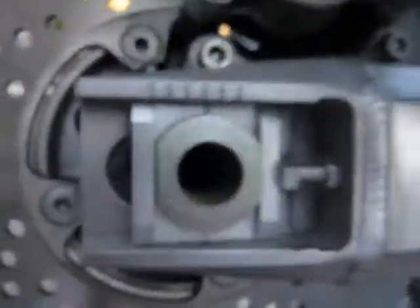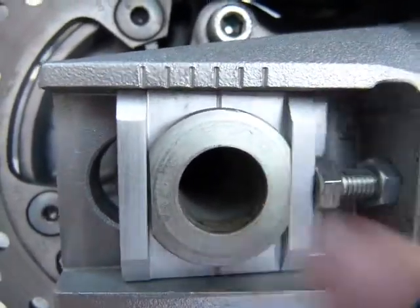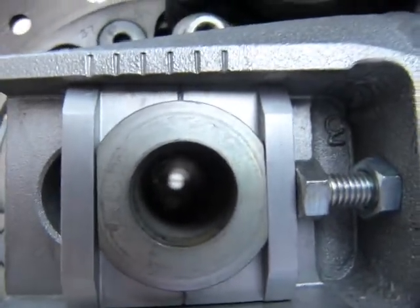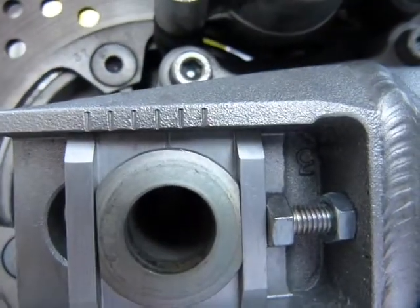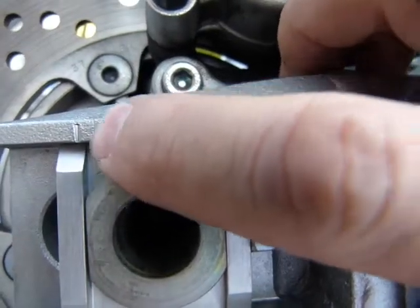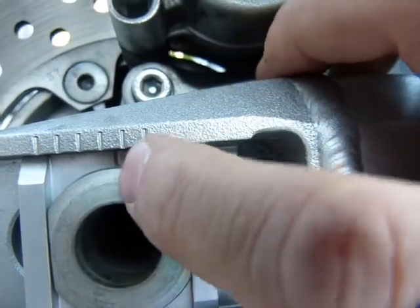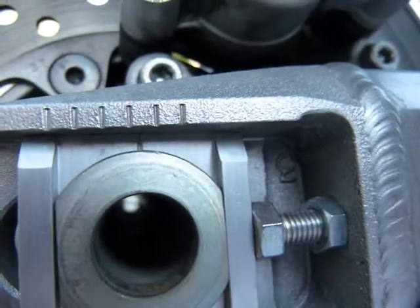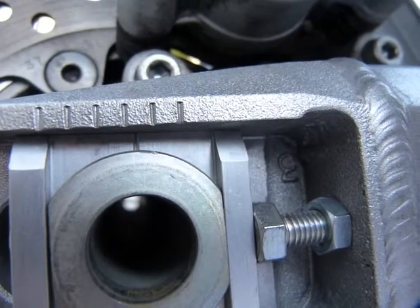Here is another example of parallax error. This vertical line there and that vertical line there marks the exact center point of the axle. The axle is hollow there. So if you take a look at it from this position, it looks like that against this stamped-in scale. If this is being one, that's being two, then that vertical mark is pointing at between the two and a half and the third mark, so about two and three quarters.